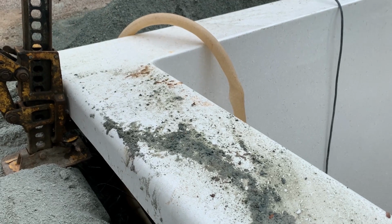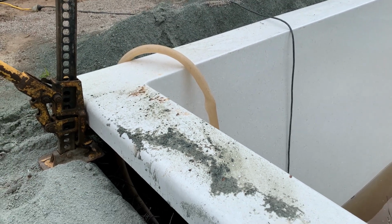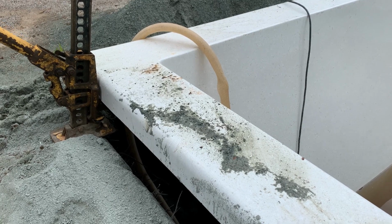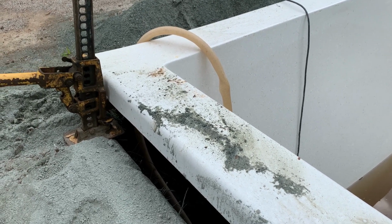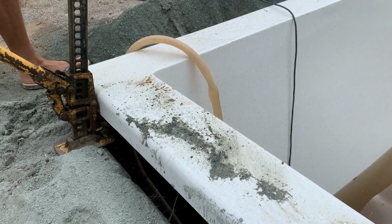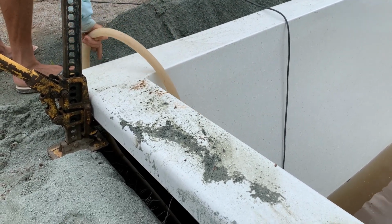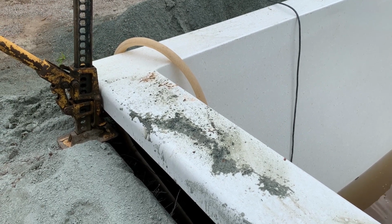You can see the water's gone still, so the pumping water into the pool has been turned off because it's now 300 mil deep in the deep end. So what the installer is up to here is just gently rocking the pool. Now, the whole time that water rod is running, and you see just how long the water rod stays in that corner to make sure that enough water and enough backfill gets washed under the corner. But by using this recovery jack, the installer is just rocking the pool up and down, no more than a centimetre at a time.